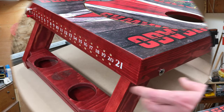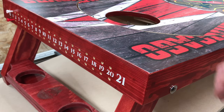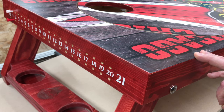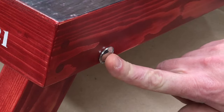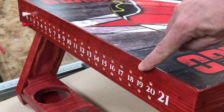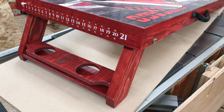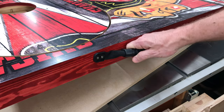After you finish watching this video — it's a mitered frame so you don't see the end of any boards. And likewise, the plywood is inset into the frame so that you don't see the edge of the plywood. I plugged the screw holes with wooden plugs and used stainless steel carriage bolts that shouldn't rust. Both boards have a scoreboard built right in so you don't have to remember your score. On the leg assembly, there's a built-in drink holder that'll hold a foam can koozie. I've added carrying handles because they're a little heavy, and this is the first time I've gotten to use my new logo.